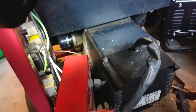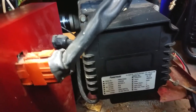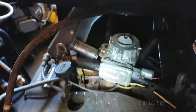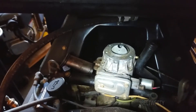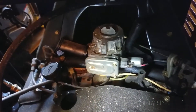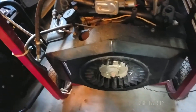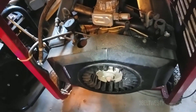I'm not really sure if the engine is going to perform well — the carburetor is kind of messed up. I was running this on propane, but I want to hook it up to a bigger load and run it on natural gas as an experiment before spending a hundred bucks on a carburetor. For some weird reason the RPM was set really low — like 2400 instead of 3600. It's got an opposed twin, 42 cubic inch engine, and it was completely full of gasoline and oil when I got it off the curb.